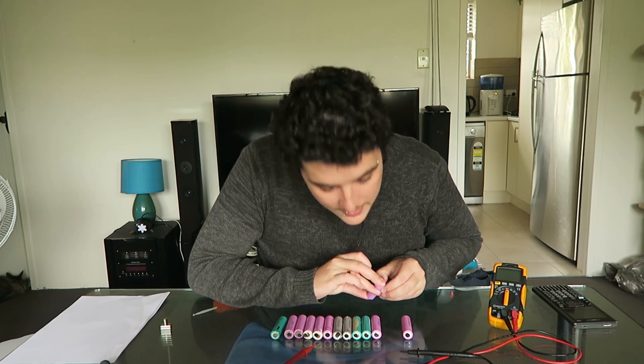If you're getting cells from batteries where you don't really know the origin, sit on the low end and deliver as little current as you possibly can. About one amp is what I want to be taking out of these cells at any one time, because I don't really know how they've been treated. These are Samsung cells so they can likely dissipate a bit more, but you don't know their story. So one amp — that's what I want to do.